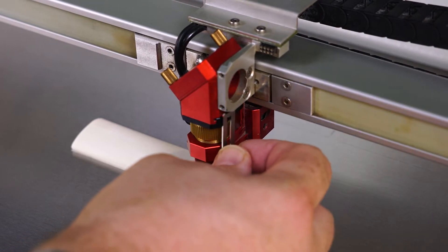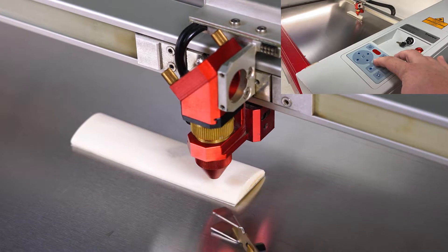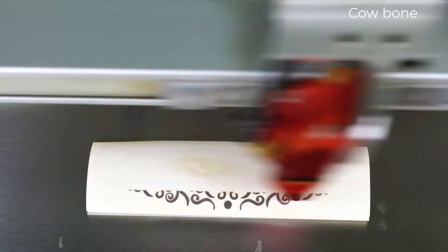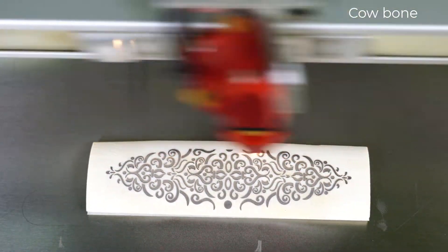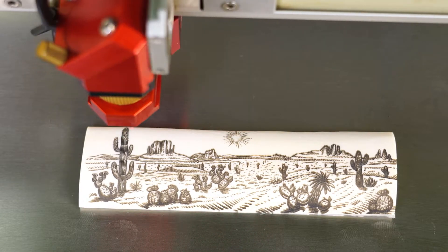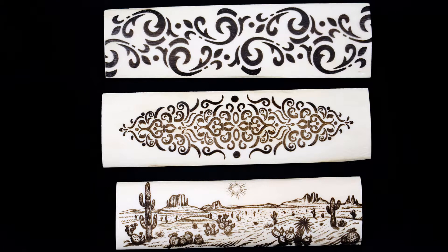Now that I know how the laser performs, I want to see what kind of tolerance is possible by engraving over the curvature of this bone. I will focus on the halfway point by manually focusing in between the high and the low points with a standard 2-inch lens with the focus tool. Running a simple image onto this cow bone, it handles the laser engraving and focus tolerance very well. A slightly more complex design again held the quality beautifully. An even more complex graphic engraved over the entire surface of this buffalo bone produced outstanding results — far better than I imagined — with great contrast and tolerance across three different bone species.